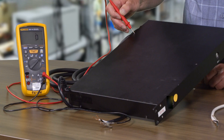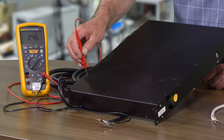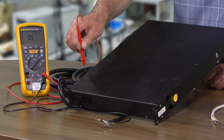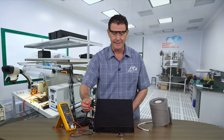You can see so far we're good. So here we go — we have a test failure. This screw, very much like this paint, the screw has not broken through the paint to get to bare metal. So that actually would be a test failure.